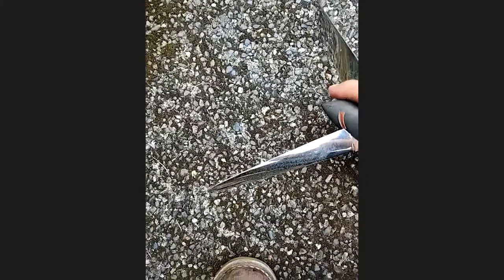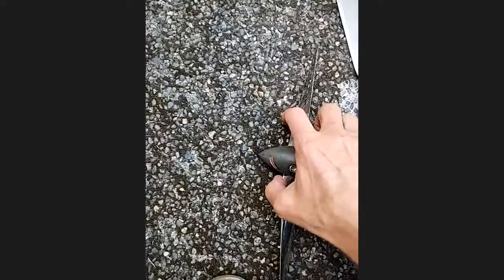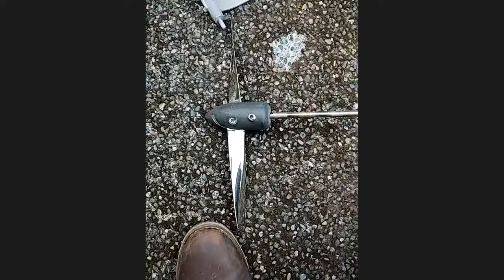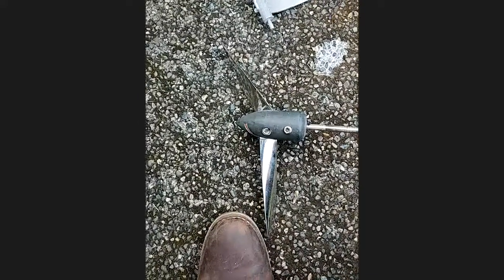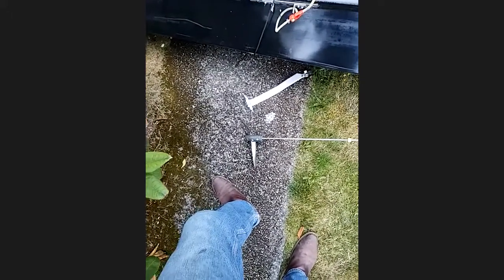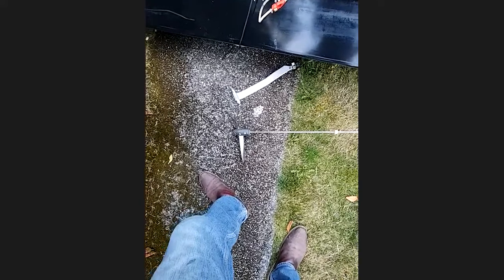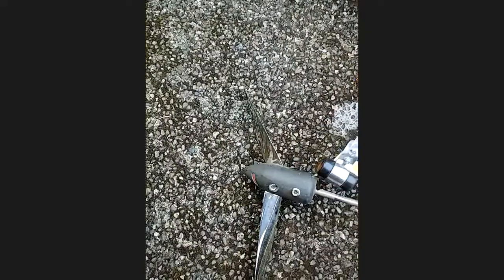Here's the propeller, which is made by Rick Willoughby. It's a feathering prop, so the idea is that when you stop pedaling, weeds will fall off or are less likely to get on there — though I don't know truly how well that works. You get a lot of weeds in the Pacific Northwest, and that's a big problem. What's pretty unique is you can run it with the propeller unattached — when you're not pedaling the prop drops down into the water, and as you start pedaling it literally aligns with the flow of the water.